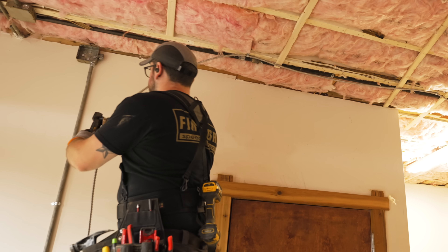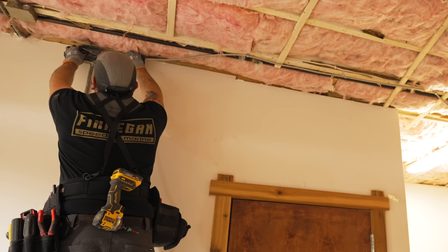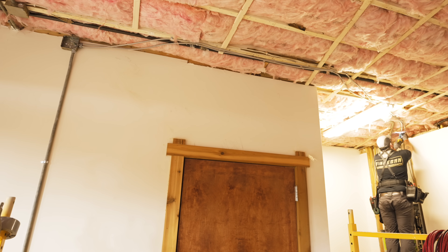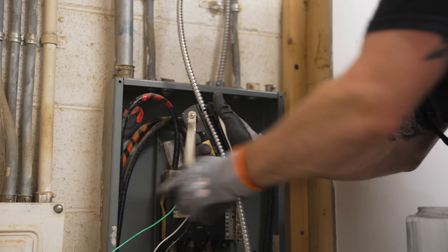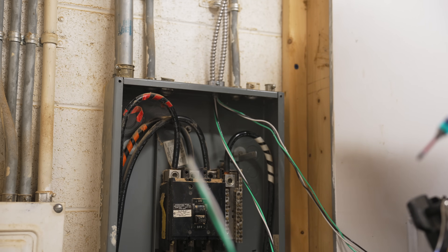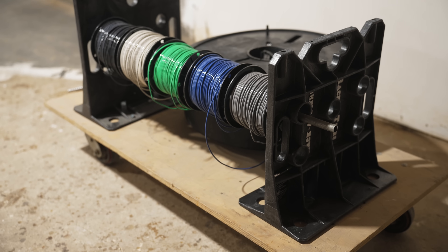If you're newer to electrical work and want to add some circuits to your garage shop, I'd highly recommend checking out MC cable — the metal sheathing protects it so you can run it surface mounted and skip all the conduit bending. I'm mainly using it in the ceiling because it's flexible and easier to run wherever I want. I fastened the MC cable every couple of feet up to the joist, and where I terminated it into the junction box I used a dual MC cable clamp to run two cables into one knockout, saving knockouts on my panel.